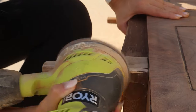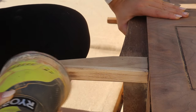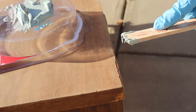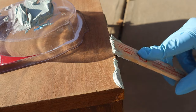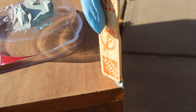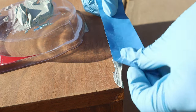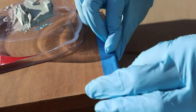There were a few areas where the veneer was missing, so I mixed up some all-purpose Bondo and applied it around any areas that needed it. I made sure to get enough on there to cover the area but still a thin enough coat so I could apply a piece of tape over that. I like doing this because it leaves a nice smooth surface when I go back to sand it — it's much quicker than something rigid and rough and it just makes the whole process easier.